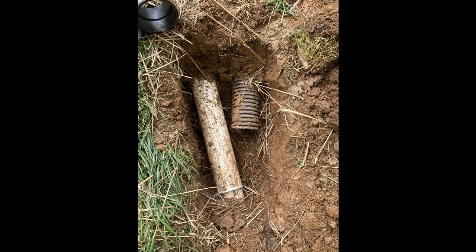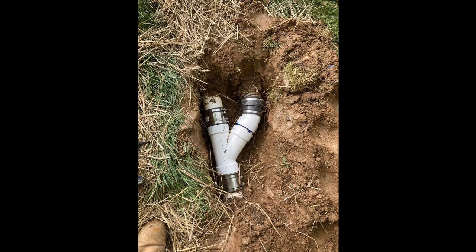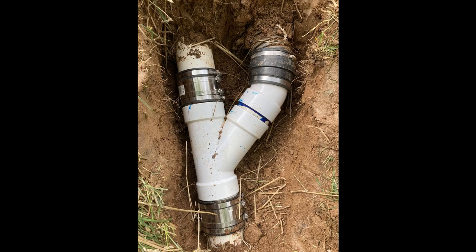I forgot to take the camera back over there when we went, but we dug it up and found the corrugated — you can see it right there off to the right, and there's our pipe. We used a street 45, a Y, and a couple of mission bands and got that piped into our system. You can see it a little bit closer there — luckily I saw that and we got it corrected before we had any major problems.